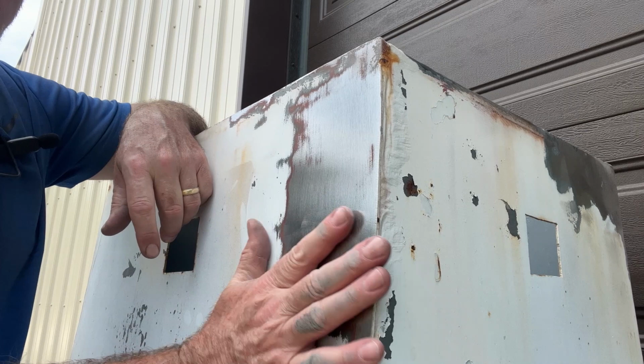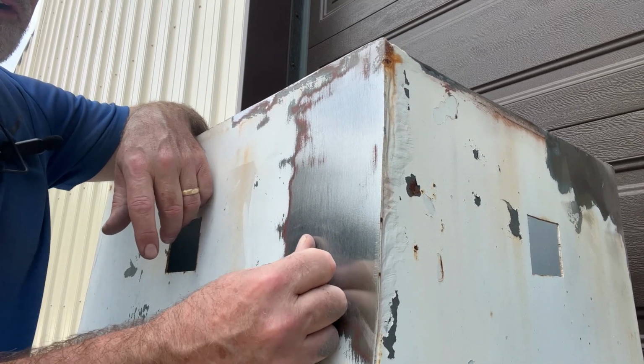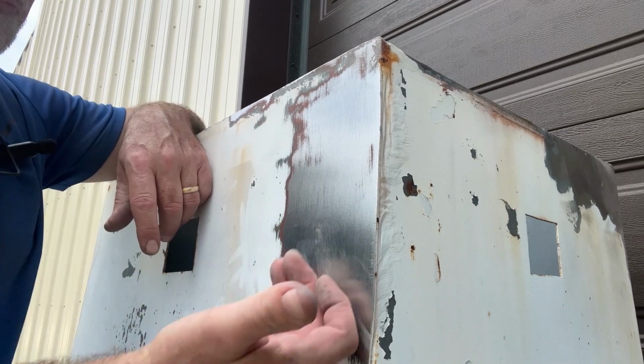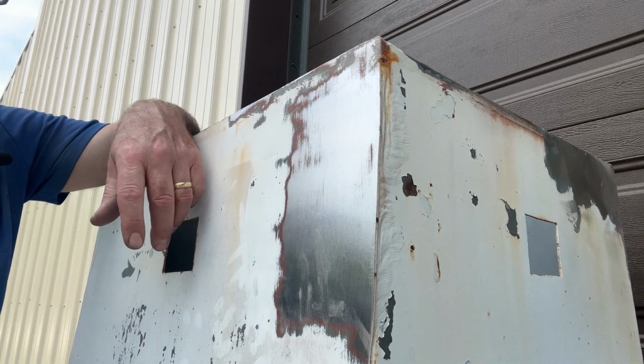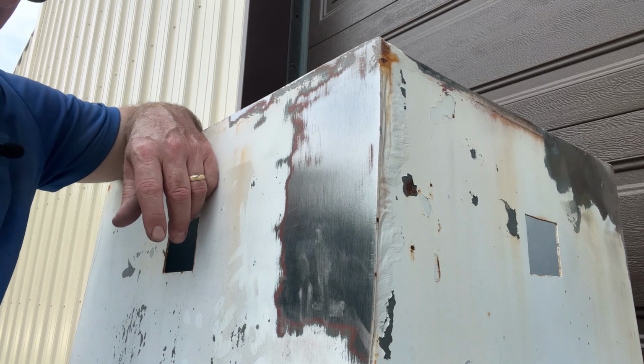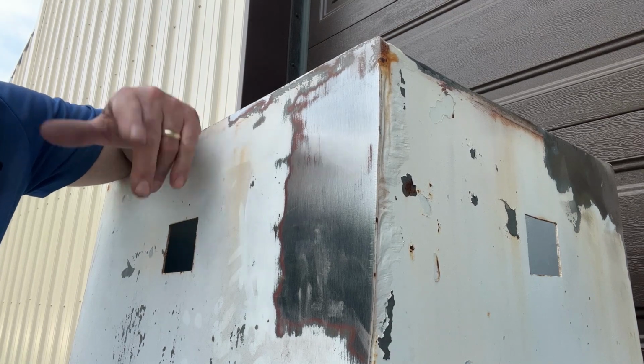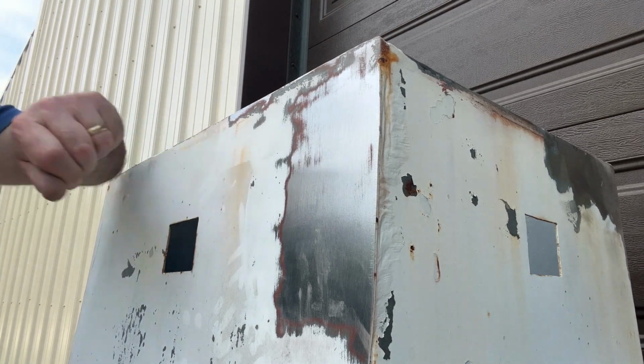So yeah, really happy with that. It's smooth, even with the 40 grit. And then I know there's enough teeth there. I can kind of feel that my primer will stick to that. So I'm going to go ahead and finish up this side of the lighthouse, and then I will have to deal with the stairs with a smaller tool. So here we go.